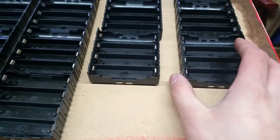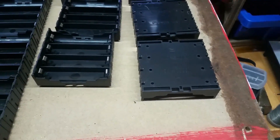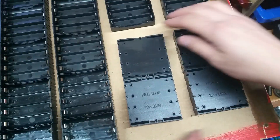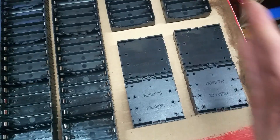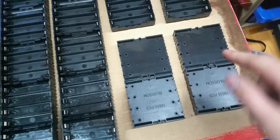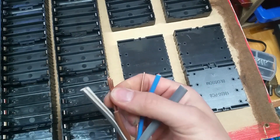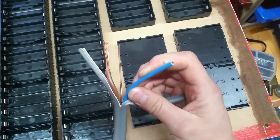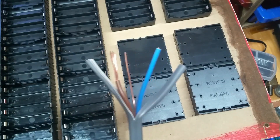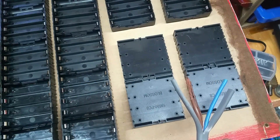The board is just a bit of wood covering up the mess below the cell holders. Thinking we'll turn a couple of these upside down — if we line two up together like this, we'll have a negative side here and a positive side here, joining onto these cells rather than going down and up to the side. We'll take some twin-and-earth; this is 6mm, but we'll get some 10mm twin-and-earth from the van, strip a core out, strip all the insulation off, and run that down the middle as a negative bus bar.